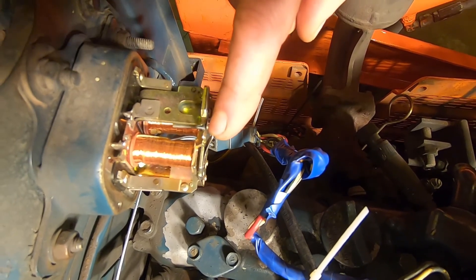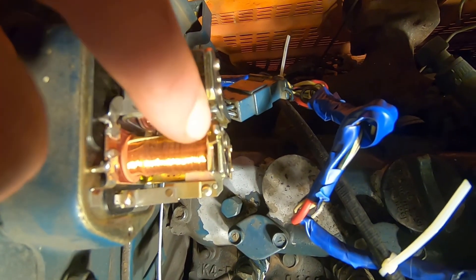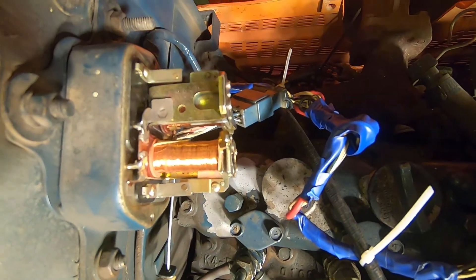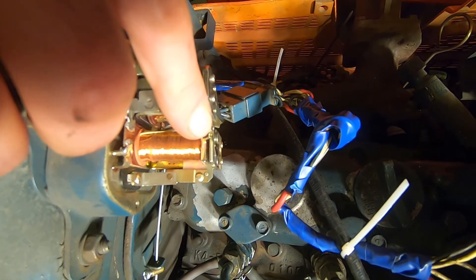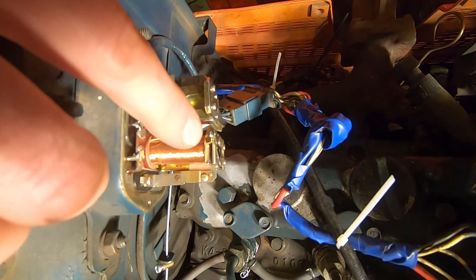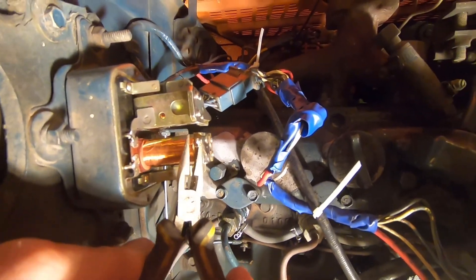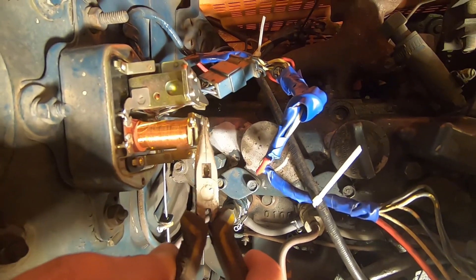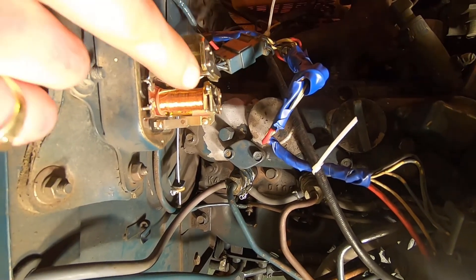I'm going to gently pry this way — I don't want to bend this piece right here — just so you can have a better look at what it touches. It touches this heavier piece of metal right here. You want to adjust the voltage of the tractor while it's running. Warm the tractor up, run at about 2000 RPM — so fairly high — and adjust from there. Don't adjust at idle, because if you adjust it at idle to the proper voltage you want, it'll end up being too high when you rev it up. Check the battery voltage using a voltmeter connected to the battery — it helps to use alligator clip leads. Take a pair of needle nose pliers; I've already adjusted mine so I'm not going to fiddle with it. You grab this and you bend this heavy piece. You're not bending this light piece. You're adjusting it using this thick piece.